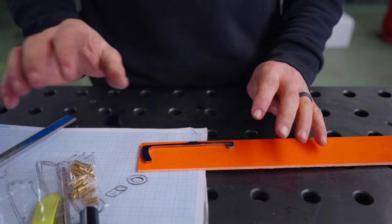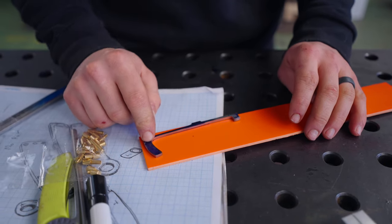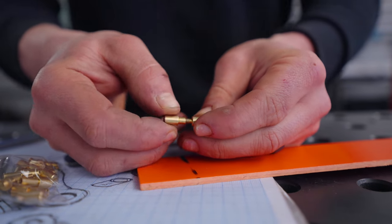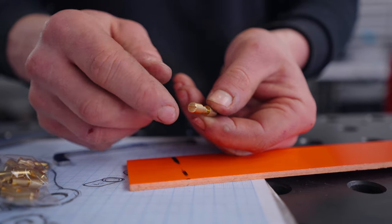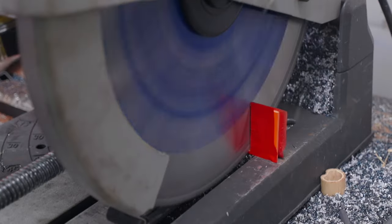While that's tempering, one of the things I want to work on is working out how I want to best affix the G10 scales to either side of our little frame spring piece. So option number one is a Chicago screw. Screws together, you tighten it with a flathead screwdriver, you grind off the excess. Let's test it. Thank you.